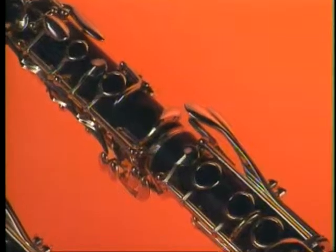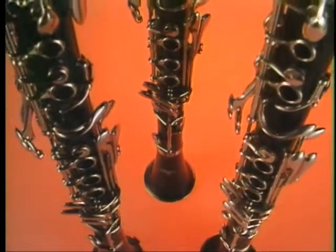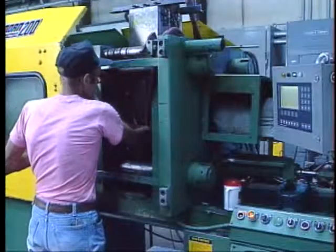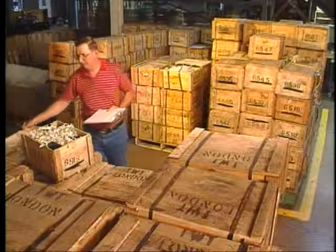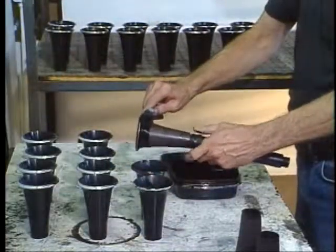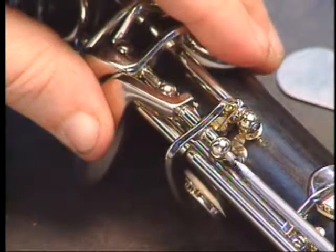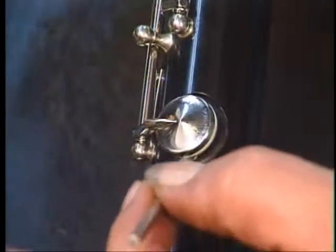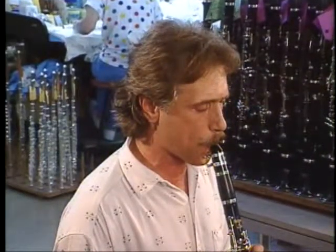Clarinets are usually made of plastic or, in the case of finer instruments, a special kind of wood. The body of a plastic clarinet is made by an injection molding process. A fine wood clarinet is sometimes made using grenadilla wood, which is very rare and expensive. Wood clarinets are turned on a lathe and bored through the center, then smoothed, polished, and dyed for beauty. Sound holes are drilled, and technicians make the keys, arms, and springs for the complicated mechanisms. Corks, felts, and pads are added to the keys to seal the sound holes. The completed horn is inspected for appearance and play tested to make sure everything works and sounds just right.